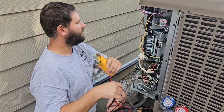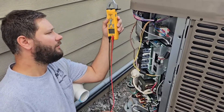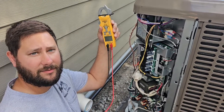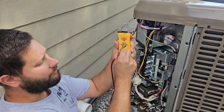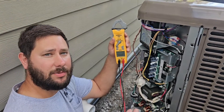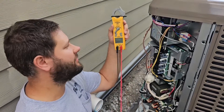We are going to check the suction pressure transducer first. For measuring the input, you should have 5 volts DC, so you're going to want to take your meter and put it on volts DC. For the output, the range should be between 0.5 to 4.5 volts DC.